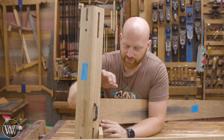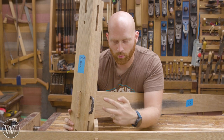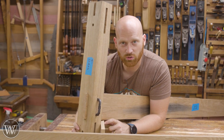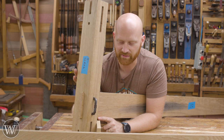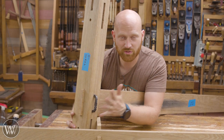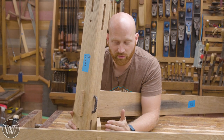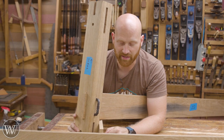So there you have it — I am in love with this little design. This is something I've never seen anyone do quite like this. Either you would put a wedge on the outside of the tenon or you would put in draw-bore tenons, but I wanted something removable and functional rather than having a wedge sticking out farther. This was something I came up with, and the pins were actually made by Rasmus Lohn Steingard — I got to meet him in England at Makers Central and he is making these for me and will be offering them to anyone else who wants to make the bed. So if you want to do the same joinery, I'll leave a link down below. Basically, this is how the main stretchers will connect to all four legs, and when we want to move we pull the pin out and the whole thing comes apart. The center stretcher just sits between the two inner stretchers and is held in place by itself.